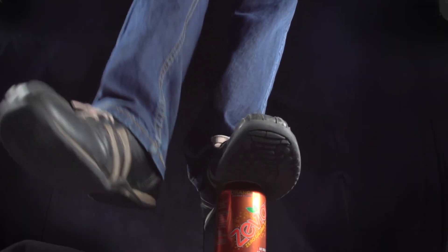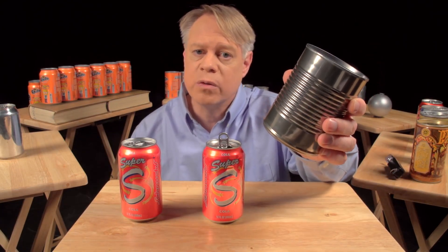The internal pressure strengthens the cans so that they can be safely stacked. A pressurized can easily supports the weight of an average human adult. It also adds enough strength so that the can doesn't need corrugations like an unpressurized steel food can. While initially pressurized to about two atmospheres, a can may experience up to four atmospheres in its lifetime due to elevated temperatures, and so the can is designed to withstand up to six atmospheres or 90 PSI before the dome or end will buckle.